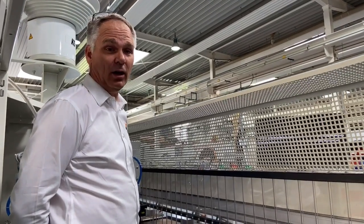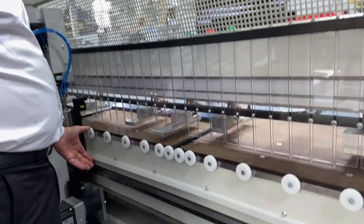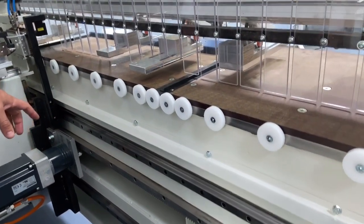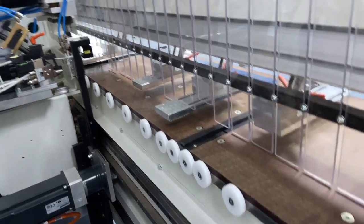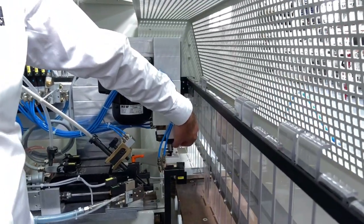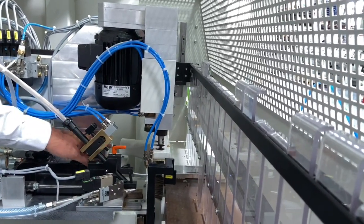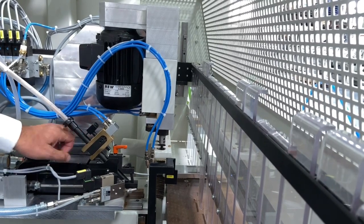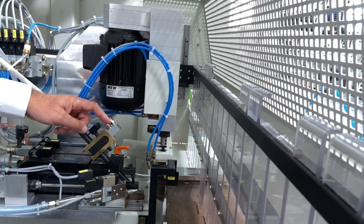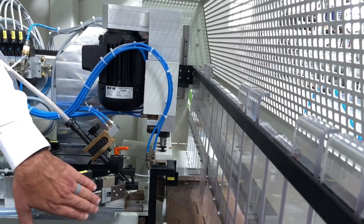Welcome to the internals of our Koch Sprint ProLine. The highest quality Bosch Rexroth motion guidance systems are used along with a super accurate rack and pinion to ensure years of reliable service. We have three vertical and independently controlled drilling heads as well as two horizontal independently controlled drilling heads with a blowout device to ensure that the dust is extracted from the hole. Following is our dowel insertion tool and our patented ELC — electronic glue control — to ensure that there is glue in every one of the holes.